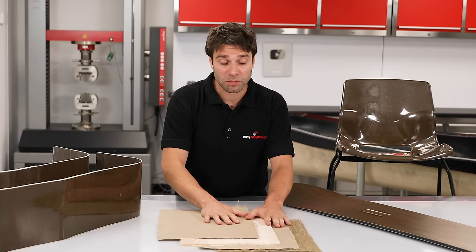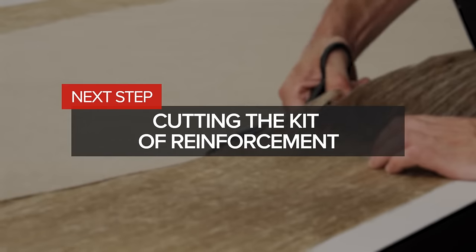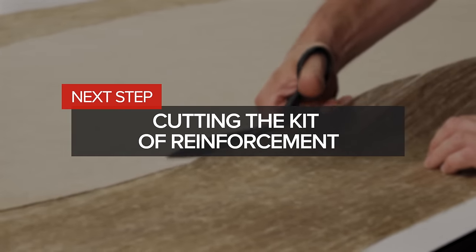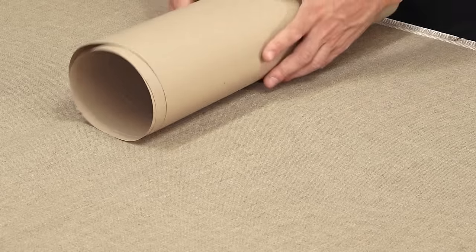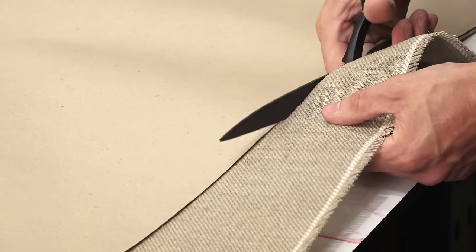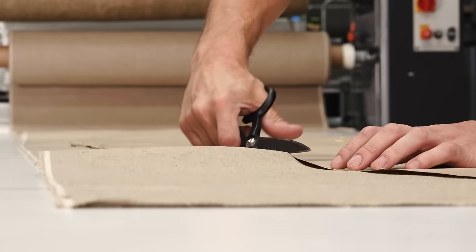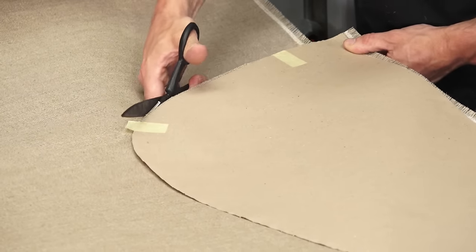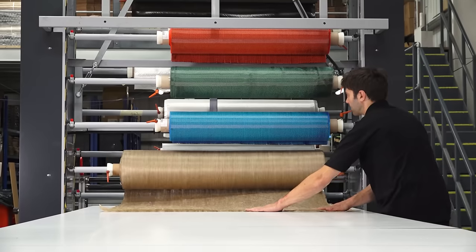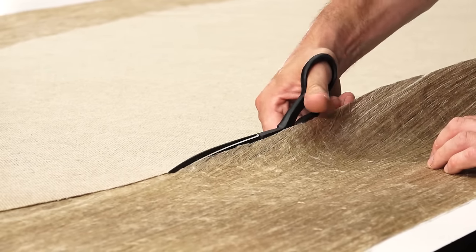With the reinforcements established, we can cut our kit of material. As this canoe has two planes of symmetry, I'm able to make simple paper templates for one quarter of the hull and flip and mirror these to create the full shapes. Each ply is made up of only three pieces — a base and two sides. Flax cuts really easily with conventional shears, but you need to be particularly careful when handling the unidirectional as without a cross stitch it is very easy to separate and damage. With all nine pieces cut we can now look at the balsa core.